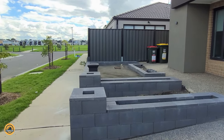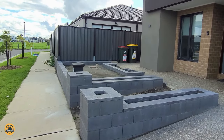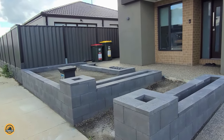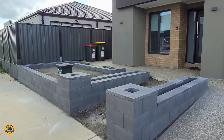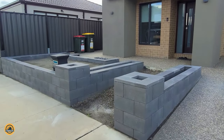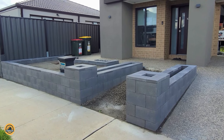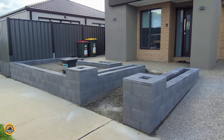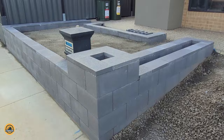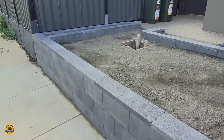I finally finished this brickworks. I started almost, I think, 10 days ago, and it cost me approximately $2,500 Australian, and roughly 40 hours of individual work. So you can plan accordingly. As you can see here, I used almost 130 standard bricks, Adbri Masonry, and there are 20 corner blocks in total and 150 caps. These are the caps which I install on top of the brick with the liquid nails.